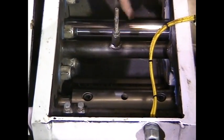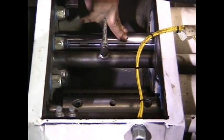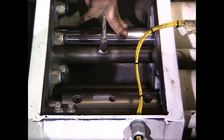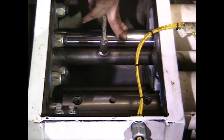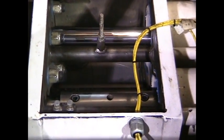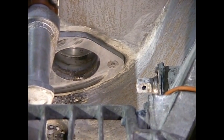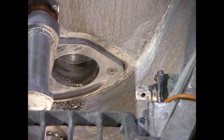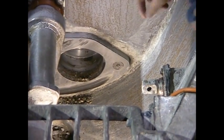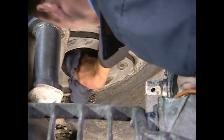I backed it up just ever so slightly — I like to leave myself a couple inches of concrete cylinder on the hopper end to install the cup. Now we're at the hopper end of the machine. My hydraulic gauges are showing zero, so I know it's safe to put my hands in here. You can see our piston adapter is tucked into the cylinder a few inches.